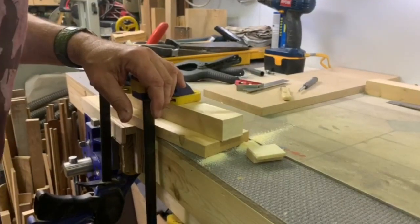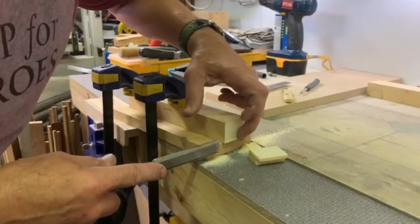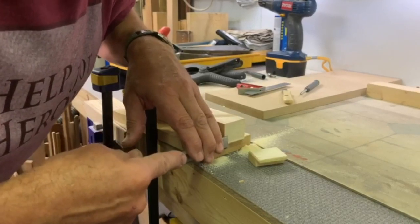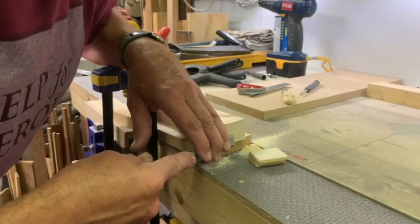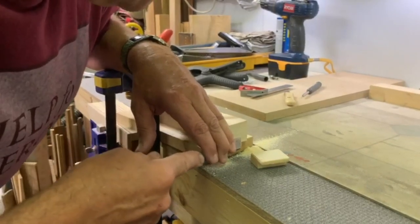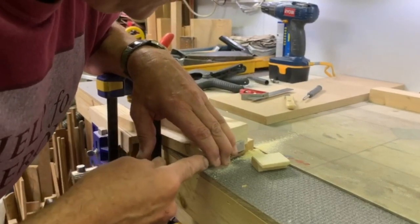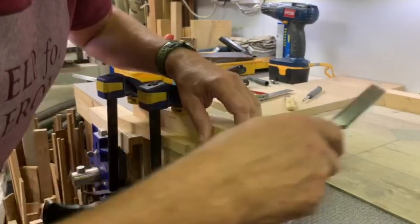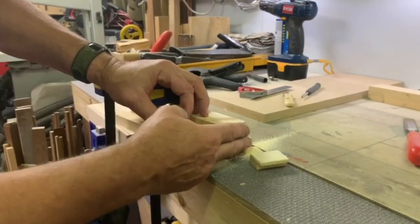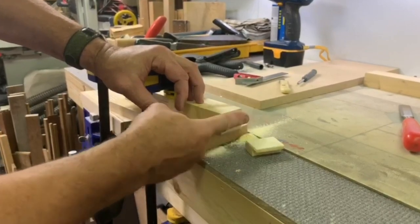What we will probably need to do is to just very carefully, on that bottom edge, where the lip of the saw was, start that chisel. Just very carefully, very carefully, shave it up into the cut. Not heavily into the timber, just nice and lightly. Just take that off. That'll remove that edge, and then you can run that just over a small piece of sandpaper, just to take the edges off very lightly. You've then got a very square edge.